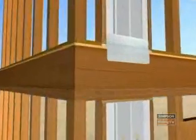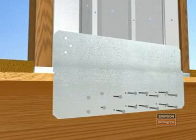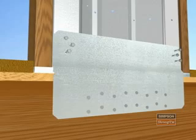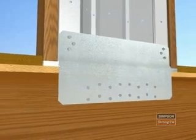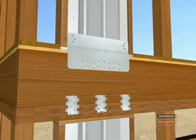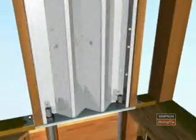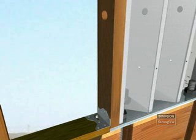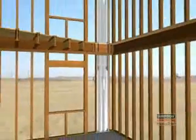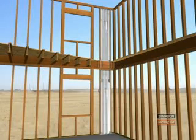The SSW shear transfer plate is then installed on the outside face using 10D nails in the rim joist and number 14 self-drilling screws in the upper strong wall. Install the specified number of LTP4s from the rim to the double top plates. Finally, install A34 connectors on each side from the SSW stud to the wall sill plate on the top floor. This is what a correctly installed 2-story stacked wall installation will look like when it's completed.